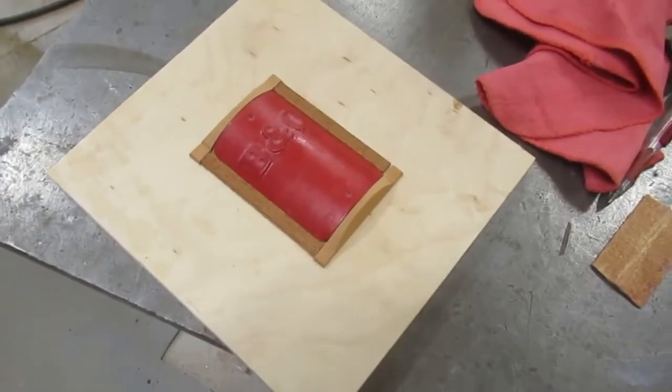If I have the camera back from Joe, I'll show you how to pour the other half. I mean, you guys have seen me pour plastics before, so it's not really that big of a deal. So what I'm going to do here, like I said, is pour this plastic, and then from here make a mold, and in a couple weeks I'll show you how to do the pattern. We'll probably make the pattern gated. I'll try to show you how to gate it. I've yet to gate that one too, so let me stick you in here real quick.